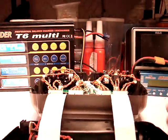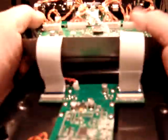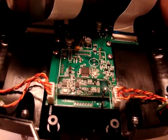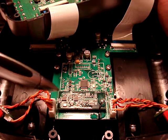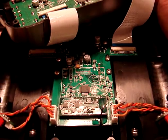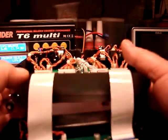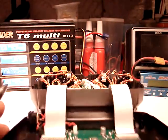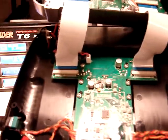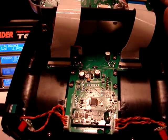One thing I wanted to point out — we had some concern about the fact that we have no working SWR. It appears that the RF module on this is actually a separate module, connected with this row of pins. So I suspect that probably if they do resolve that issue, those of us who have the early release Tyrannus can probably fix that and get the SWR working just by replacing this module.